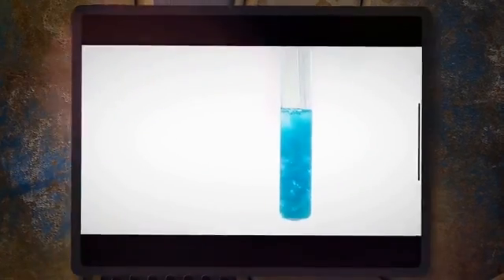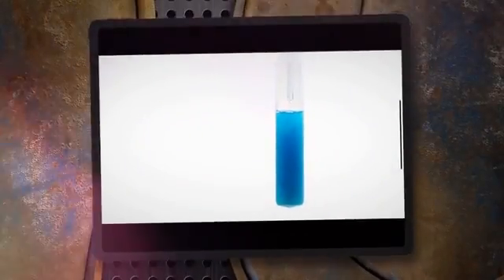The copper sulfate test is used for the following materials: SS-200 series, SS-300 series duplex stainless steel, precipitation hardening alloys, and 400 series stainless steel having more than 16% chromium. During welding of stainless steel components, iron particles can stick to the parts and become initiation points for corrosion — a copper sulfate test can confirm no free iron is present. It is also used when a carbon steel component is clad with stainless steel or Inconel alloy to verify the surface is free from iron.